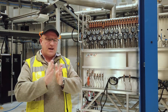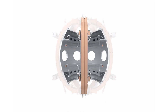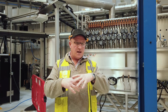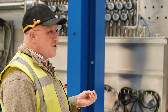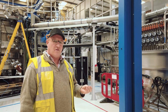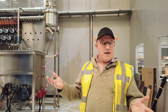It takes us four days to get the tons and tons of copper coil inside down to minus 177 degrees Celsius. And in all that time, all the copper coils around the inner vessel are in vacuum. We have very large pumps sucking out the air continuously. We can't actually have any liquid nitrogen in the tokamak when we fire it, because liquid nitrogen has the ability to expand over 700 times its volume when it goes from a liquid to a gas.